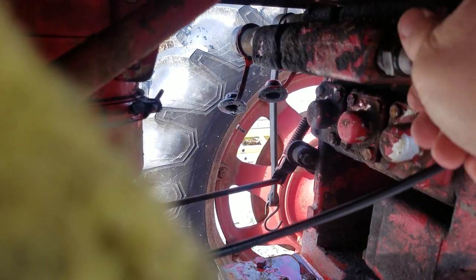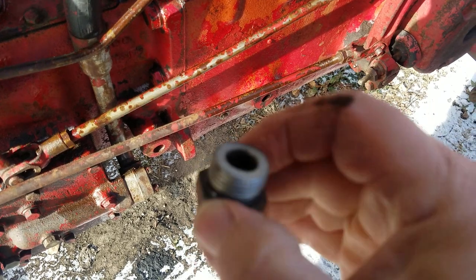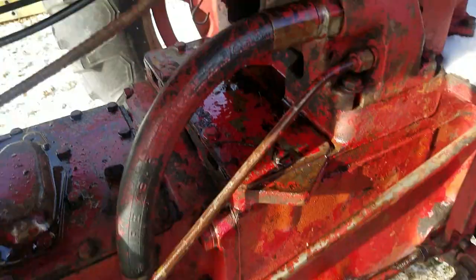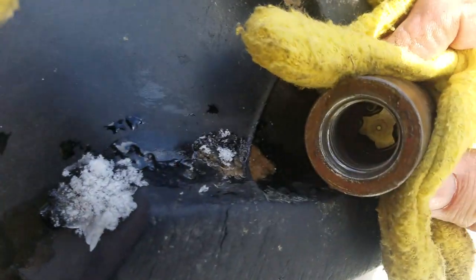That O-ring's hanging in there pretty good. Anyway, it's got a flare on one side. The threads are the same — it doesn't make any difference which way you'd actually put it in. And it does have O-rings here, so that is an O-ring boss in there, and it's an O-ring boss right here too.